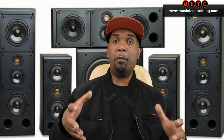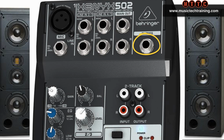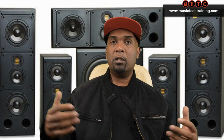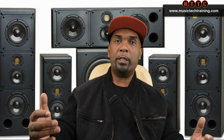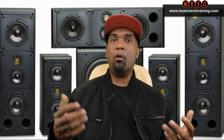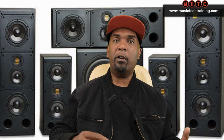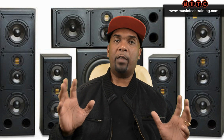Another benefit of having a little mixer is that you get an additional headphone out that you can use maybe as a producer or recording engineer, whilst the performer is using the headphone output from the audio interface. That's of course if you're short of outputs. Of course, it saves you as well having to get up each few minutes to reach around the back of your speakers to switch them off and then switch them back on throughout all of your recording sessions. Now, all you need to do is move a couple of faders which sit right in front of you, and that will solve that problem.